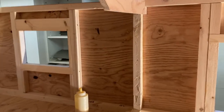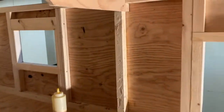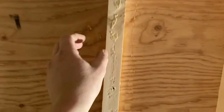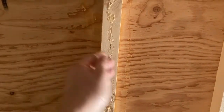So I had some inch-and-a-half wide pieces attached here — it's actually quite a crucial structural element that ties in with the front of the cab over there. If I would have left it, I would have had to build this whole thing out at an inch and a half thick, and tack on more wood so the paneling had something to land on. So I'm taking it off and putting a three-quarter inch wide piece, which will leave a cleat for the paneling and save a little bit of space on both sides. It'll all make sense in a moment.